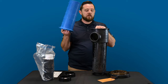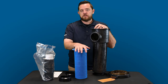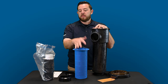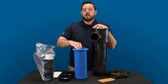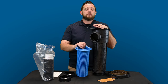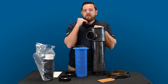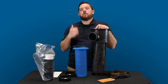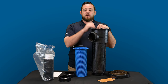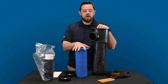You can definitely fit quite a bit of leaves in here, especially through those monsoon seasons for us out here in Arizona. I imagine back East, you guys dealing with a lot of fall, losing a lot of leaves — this is definitely a good way to pre-plumb in and make sure that that pump doesn't have to fight all those leaves and debris. It saves you the time from having to go out quite as often to empty your pump basket, to make sure all the debris isn't clogging up your impeller and burning up your pump.